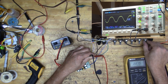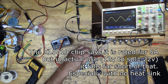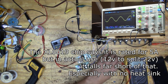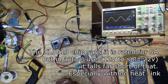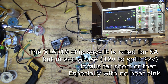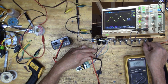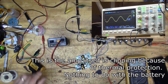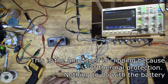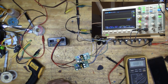It's starting to fall apart. If I turn it down, there it comes back. That's not great - I think I need a bigger converter for the power amp rail. Maybe my battery is just going down. I'm going to charge my battery first and see if the battery isn't able to pump out enough current. I'll come back tomorrow.